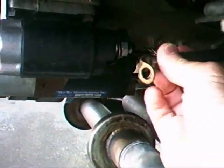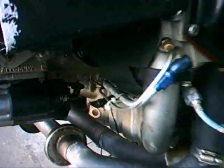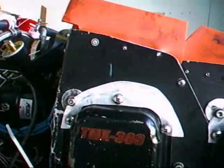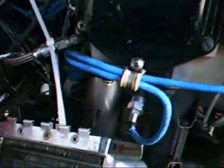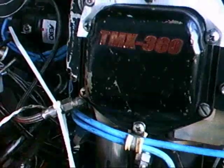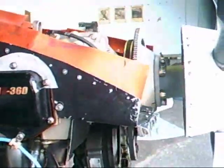To demonstrate this, I'm following the manufacturer's procedure. First, you don't want the starter spinning while you're doing this, so the easiest way — see this wire here, this is the wire that went to the starter — disconnect the wire. If you unplug the toaster, you can't make toast. The next thing I did was synchronize my propeller to the proper cylinder that I'm going to test it on, just like setting the timing on your magneto. I chose cylinder number 3 — this is 1, this is 3 — just because physically it's in an easier place to demonstrate. You come up on the compression stroke of cylinder 3; you can take out a spark plug and put your finger on there and feel when that happens, and then you know you're at the point where the points in the magneto are going to fire open. When you're moving the propeller, take all the necessary precautions. Some people like to take the spark plugs out of the airplane entirely so you know it can't start — I just disconnect all the spark plug wires when I'm doing that.